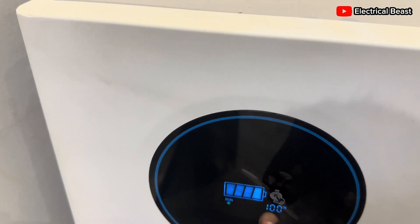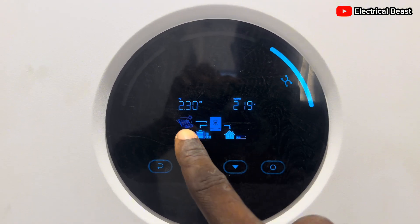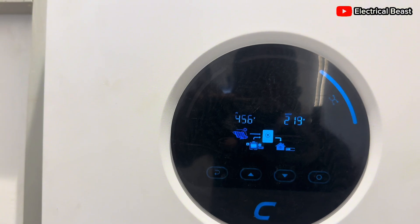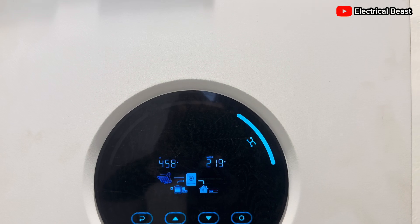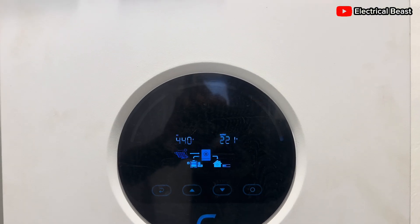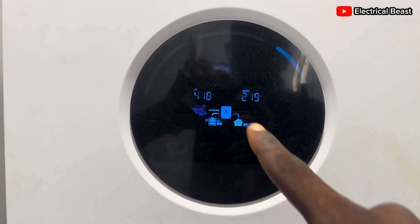You can see the battery is full — 100% SOC. Let's check the SOC on the inverter as well. The wattage has increased to 2.3 kilowatts and we have 454 volts. If you divide by 10, you get 45 volts, meaning on average each panel connected in series is giving about 45 volts.